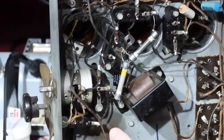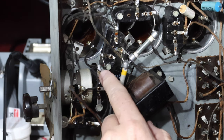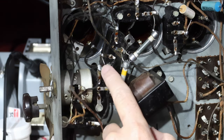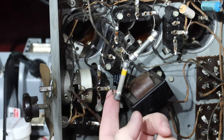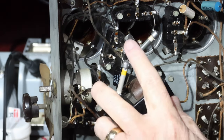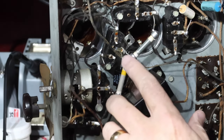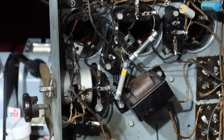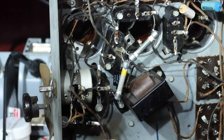Okay, so we got capacitor number 5 done. I had to go ahead and disconnect or cut this lead that was short in between them, and also this resistor, so I could wrangle this one out. But I've resoldered them back in so I can do my testing after each capacitor I replace, and then I'll cut this one back out and so forth. Anyway, going to the voltage test power up. Coming up.